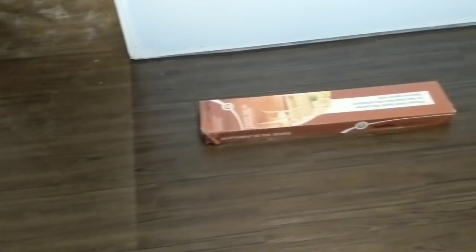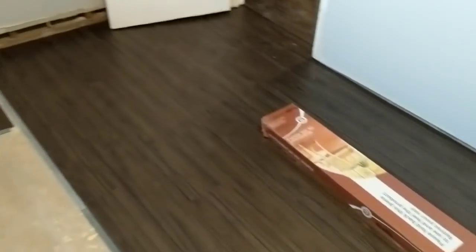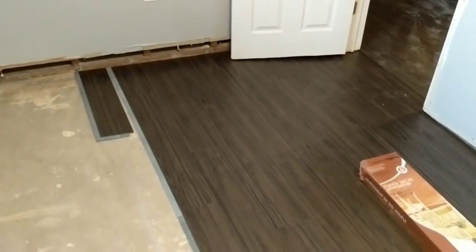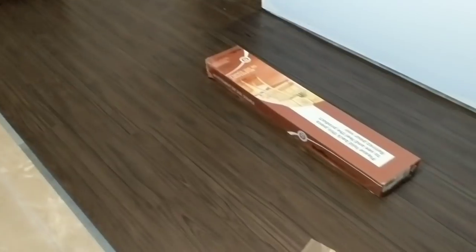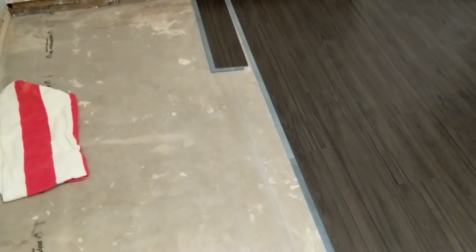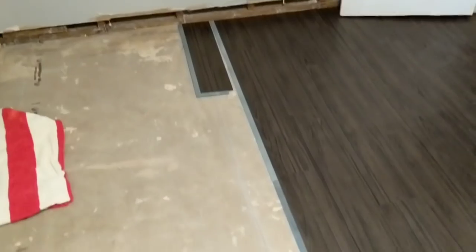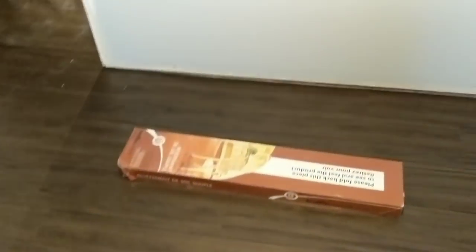I hope you enjoyed this video — if you did, give it a thumbs up and leave a comment. This flooring is great — go to Home Depot and pick up the Allure Traffic Master Ironwood. Also, you'll notice I have a poly underneath — it's just a six-mil poly. You don't need it, but I'm in a basement with potential moisture so I used it as a precaution. Thanks for watching and I hope I helped you with your next project!